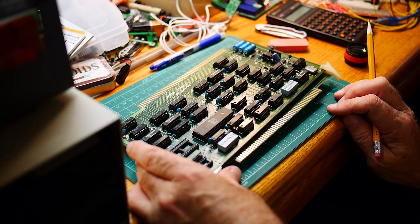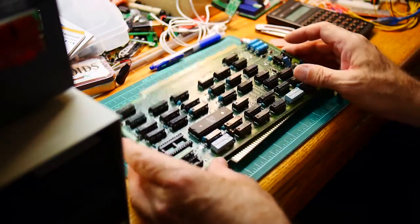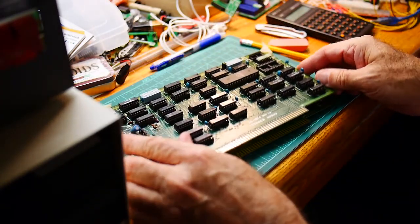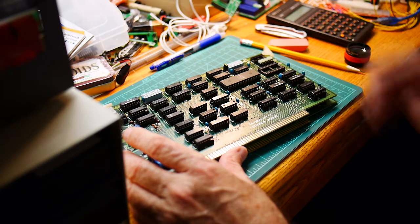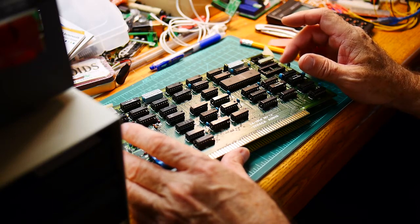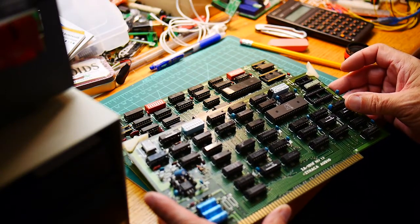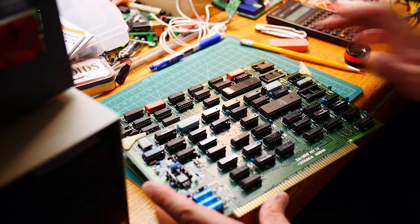I'm assuming that one probably worked or had a closer chance of working. It has the full chips but is missing U35, and so might this one. It could be the vectored interrupt chip - either an 8212 or an 8214. The 8212 is a D flip-flop latch, a parallel port, or it's the 8214 which was an option you didn't need. None of my computer stuff needs a vectored interrupt, so it could be that.